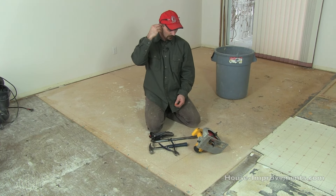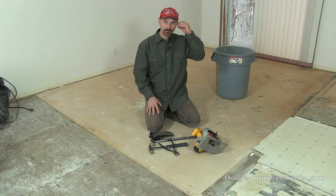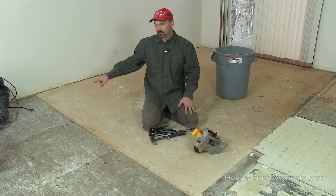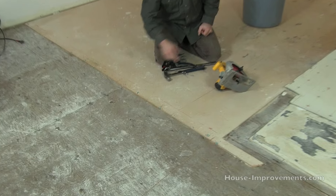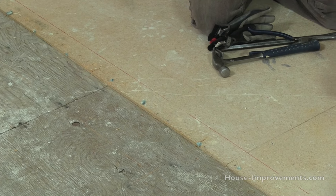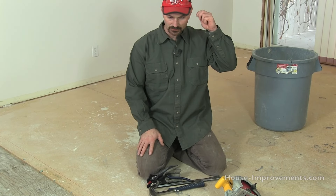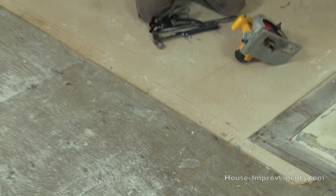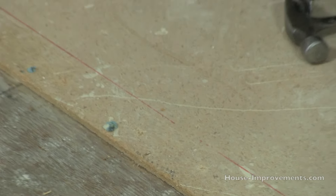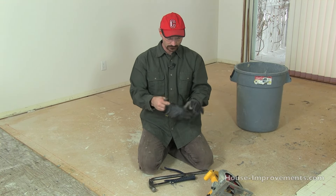So I'm going to get my safety gear on and make some cuts. These materials are usually four by eight sheets. Most of the stapling generally is going to be around the perimeter, so I'll run my saw about eight inches from the edge of the perimeter of all the sheets — going all the way around — and then about every couple of feet I'll also cut across the sheet. That'll make it a little bit easier to get up in a few less small pieces. I'm also going to wear gloves for the bits of staples that can be flying off the blade.